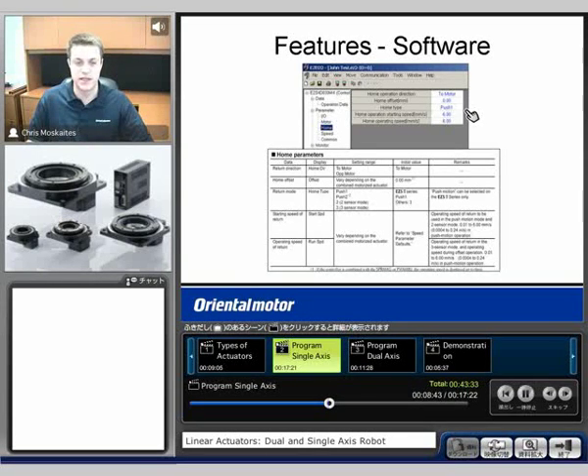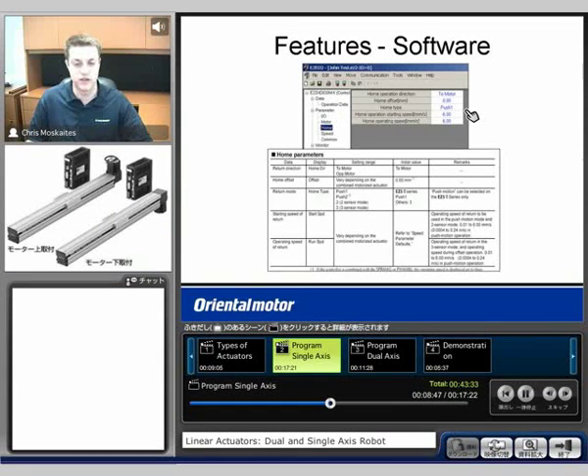Home type — if we're doing it with sensors or not sensors. We can do sensorless homing with most of these actuators, where it will very slowly move back until it hits a hard stop and then offset slightly to a home position. In our demo we've used sensors on one axis and sensorless homing on the other axis, so we can show both of those once we get to the demo.